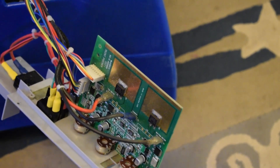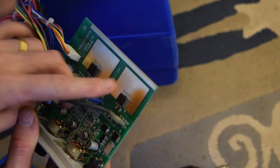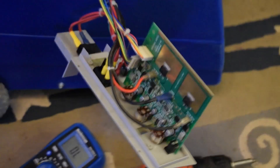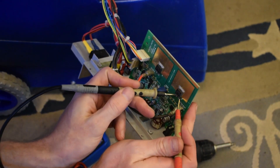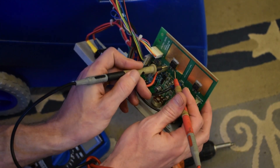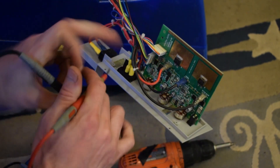So on here there are two ICs. This is an R937P, and when I measure the two outer legs, I'm getting a short on this guy here, but if I measure on this side, I'm measuring 0.8 forward voltage.